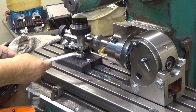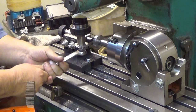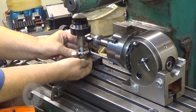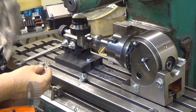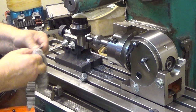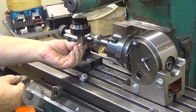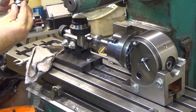This is number two, and what we are really needing here is number... Which way does this... Not that way. So, we need number six. Number two is wrong here. These gear cutters are numbered. For each module you have 8 cutters and each of them is dedicated for a certain number of teeth range. This one, I don't recall what the range was, but anyway, this is now the correct one for this number of teeth we have here.